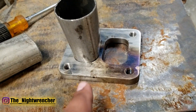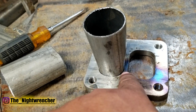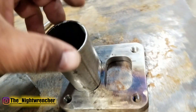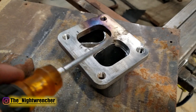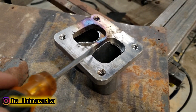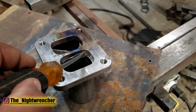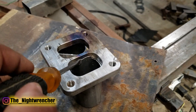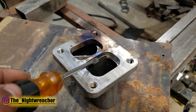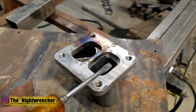Welding this whole thing up is actually pretty easy. What you're going to avoid is welding down here in the middle. You're going to start at this corner and weld all the way around toward the outside all the way to the opposite corner. When you weld on the outside this whole pipe is completely sealed except from here to here. When you flip it around, start your weld a little bit into your existing weld, then cross to the other side welding this little tab onto the flange, and run all the way to the other side to meet up with the weld you just did on the outside. I personally like to weld both the outside and the inside as much as possible just to give it a little bit more strength.